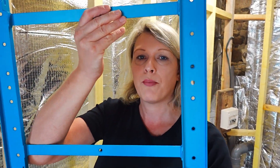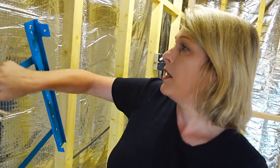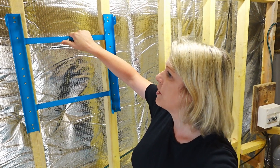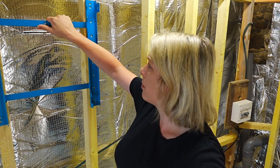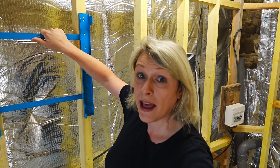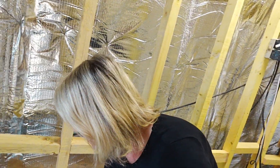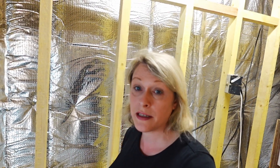So that's where we're up to today. We've got this bracket here for the Victron inverter, and I'm going to reinforce this section of the wall. I'm probably going to put some extra bracing in here because this unit is really heavy — it's like 100 kilos — and I want to have provisions for two inverters in case I expand the system in the future. We're going to put some extra reinforcing in this wall, make sure we've got space for all of the brackets and that everything lines up with the stud work. The charge controller is probably going to go here so I just need to make sure we can fit everything.